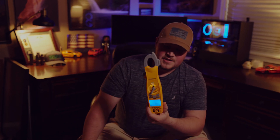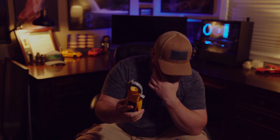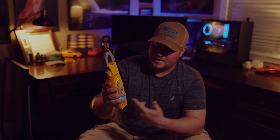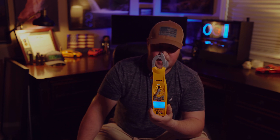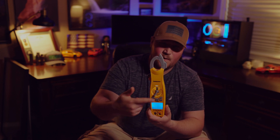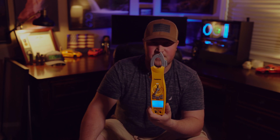My biggest complaint with this thing so far — which is kind of a deal breaker for me — is that I found when you're running the wireless portion of this, it throws the amp readings completely off. I first found this on the pump I was testing the hertz readings on. Once I ramped that down to 7-8 amps to get the frequency to read correctly, I noticed that whenever I turned the wireless on, my amp reading was reading higher. I'll put some footage in here now so you can see what I'm talking about.